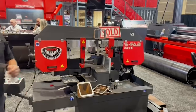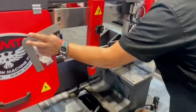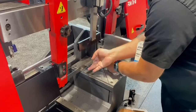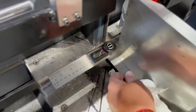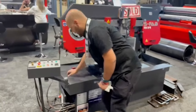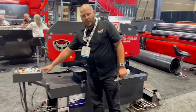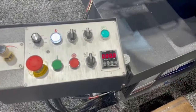Once you loosen the bow, you can bring your indicator in and make sure that we are at a 90. So now we're at a 90 degree — it's hard to see but we're at 90 degrees. I'm going to lock my bow one more time, then turn my power switch back on, and now we have a true zero, or 90 degree straight cut, confirmed on our system.